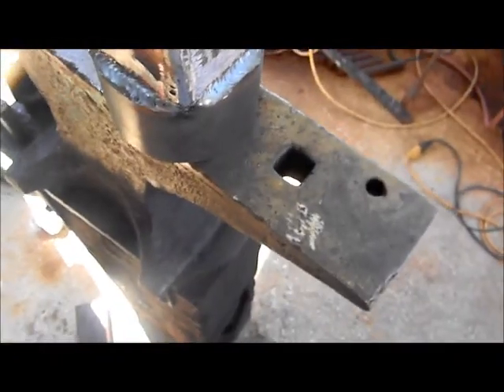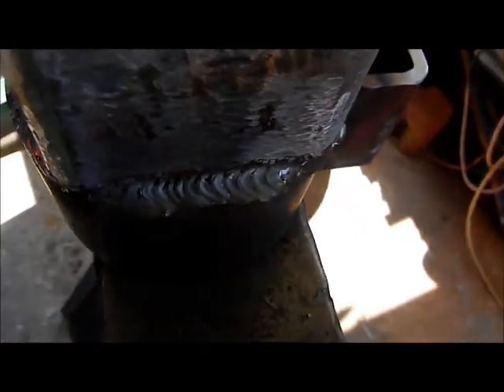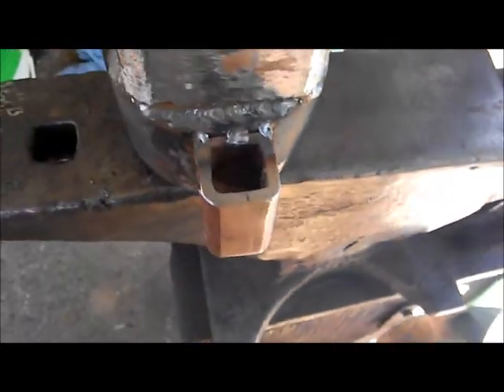See it hollow. There's a little piece of tube still in there and I've ground it all off so the concrete will bond to it. I didn't weld the bottom of the tube — I didn't see where it needed it. I did the sides and the top. I figured that's all it needed.